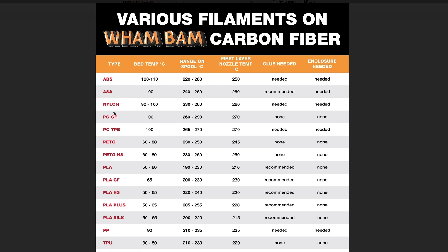I didn't have any ASA, nylon, or PC, but for PETG I didn't use anything — as the guide says — and had really good luck. PLA was interesting; they recommend an adhesion promoter. I had some prints where it worked fine, and some where I didn't use any promoter and wished I had. Polypropylene and TPU are pretty self-explanatory. This is a guide they include with the print bed, and if you follow it, you're going to have great success with the carbon fiber bed.